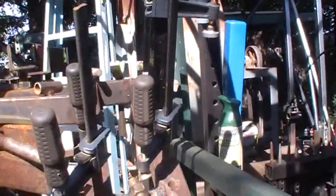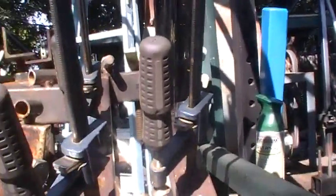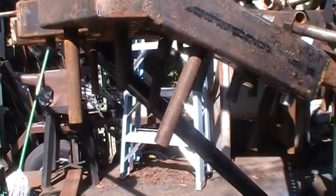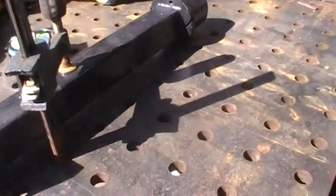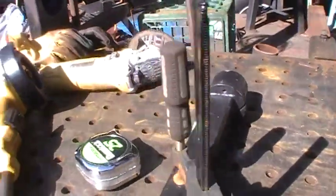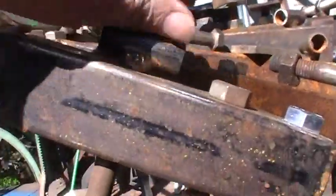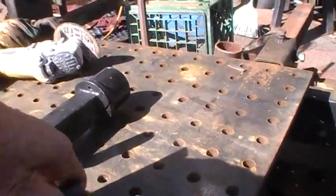They make really good ones that are cast iron — that's the best way to go because cast iron is just a really stable material, whereas this is just mild steel. But it has upped my game; it has made things so much easier. So what I did was make a fixture holder to get everything off the table. I went to Harbor Freight, got their little $3 to $3.50 holders, just cut the end off and welded a piece of five eighths round bar. I used hot roll — you take hot roll, buff the mill scale off, and these holes are 16 millimeters, which is three, four, or five thousandths over five eighths. That's all the tolerance you need.